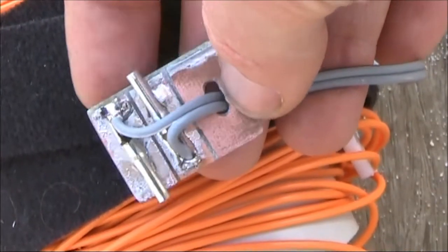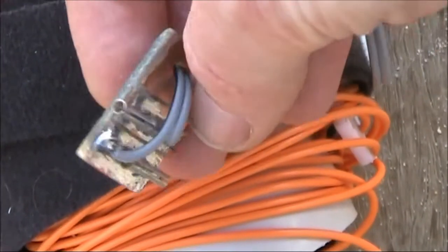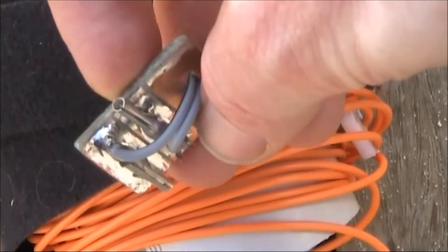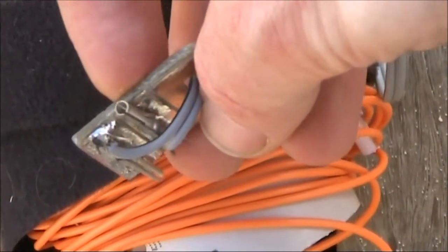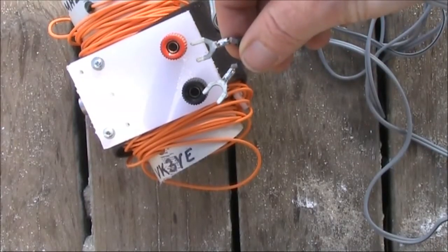At the end of the figure eight is a small piece of printed circuit board material that has sockets attached. They actually come from those nylon power connections, usually with three, six, nine or twelve pins or so. I'm using the other ends for the antenna wire, and then some spade lugs which go to the balun.